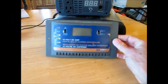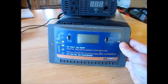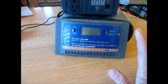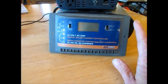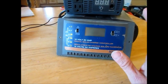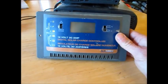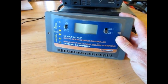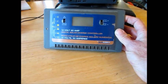The next component you're going to be looking at is a charge controller — and look at this, this is just a real small one. Note that a lot of home kits, like Harbor Freight and Renogy, include a charge controller with their kit, so you really don't even have to worry about purchasing one extra. But because we wanted to add more solar panels to our Harbor Freight array, we ended up having to buy a larger charge controller. A charge controller just prevents excessive overcharge of the batteries, and it does need to be sized according to your array.